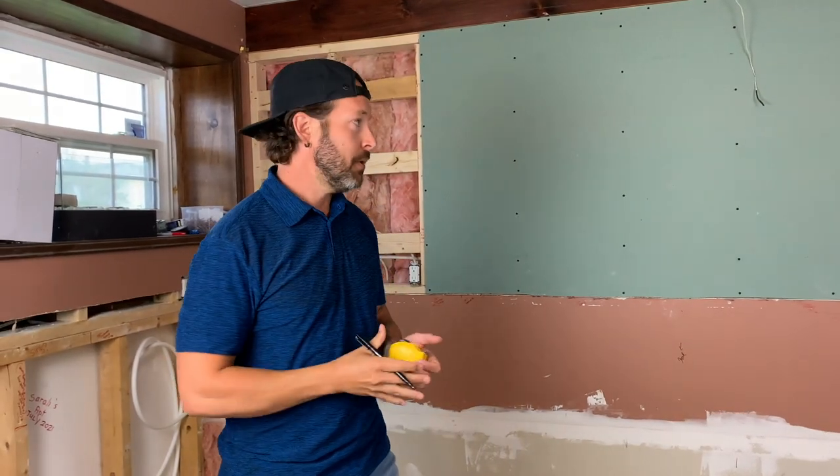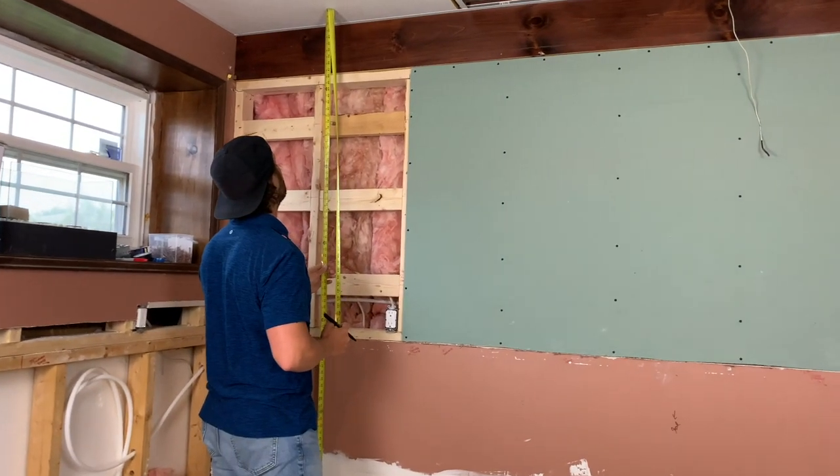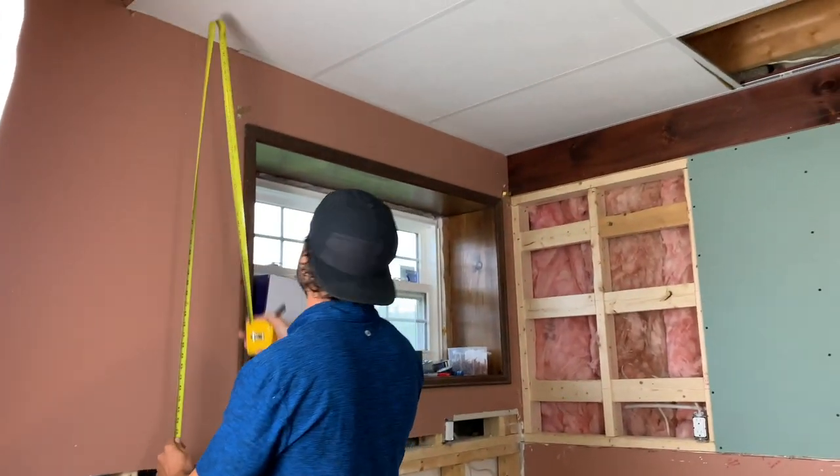It's always good to measure the ceiling height so that you know how much room you have to deal with, especially if you're going to put cabinets over any appliances like your fridge. I'm measuring the ceiling in a few different places to get an idea of how level the ceiling is overall — I want to find a low point. This comes in really handy when you're installing to the ceiling because if the ceiling is not level, it's very important that you know that before you start installing so you can plan ahead.